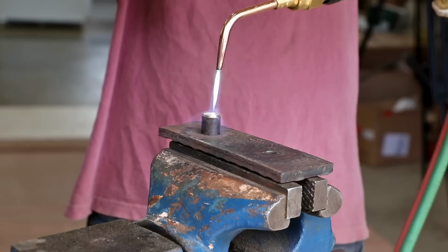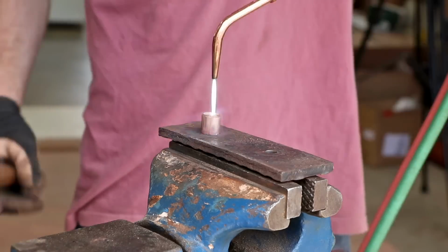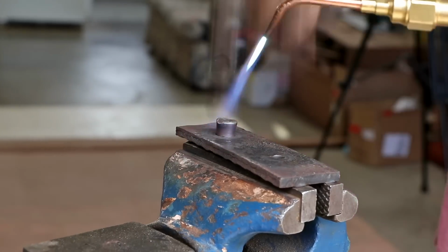So I'm going to hammer the heads onto the bolts by hand, cut the threads into them with the threading machine, and they will fasten the transom to the sternpost. At the fashion pieces, there will just be screws fastening it, but that should be plenty strong enough in that area, especially as eventually there's also going to be screws coming from the other direction, from the ends of the planks into the end grain of the transom. A few people were concerned that the end grain of the transom might be exposed and therefore vulnerable, but it won't be. It'll be completely covered up by the ends of the planks.